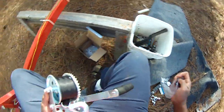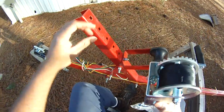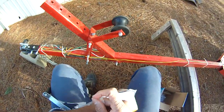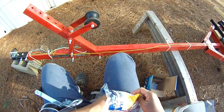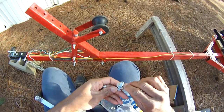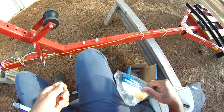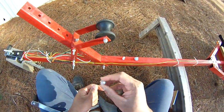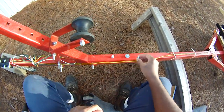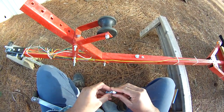Finally got some bolts. I was hoping that at Walmart or wherever they would have a mounting plate, but hopefully this will be good. The book recommends three-eighths-inch mounting hardware. So you go to Lowe's or somebody like that and get yourself a one-inch by three-eighths-inch bolt, three-eighths-inch washers — I'm only going to need two but got four just in case. I've quit using lock washers or split washers and gone with nylon lock nuts. Hoping I got these in the right size.